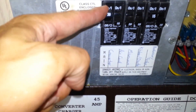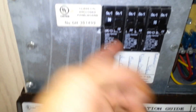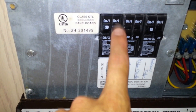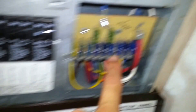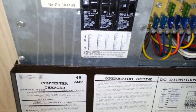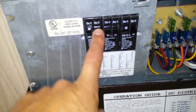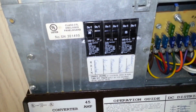An important feature of the power inverter — the way that it's wired up, because it feeds 110 to the panel and everything else, some considerations need to be made. This is the main right here — that shuts everything off. And then this is the converter. The converter converts 110 AC into 12 volts DC, which will supply power to the entire 12-volt system, including charging the battery. Now, it would be very unwise to use the inverter — running off the batteries — to run through the converter to charge the batteries. Not going to work. It's just going to kill your batteries.